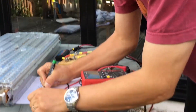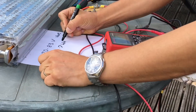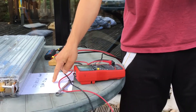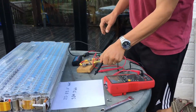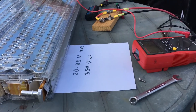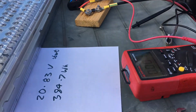I'll write down 284.7 watt hours. Now we know where we started with the voltage and how much power has gone into it. A couple of hours later, I need to test the final voltage — the surface charge will have gone away. The voltage now is 21.35 volts. I'll write that down here.